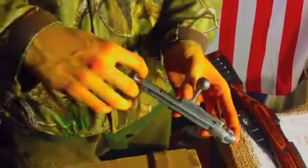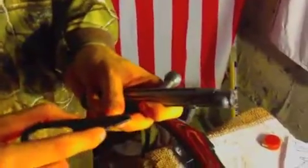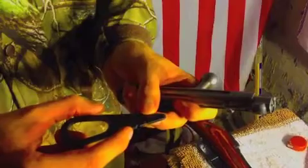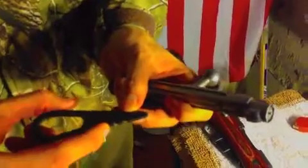Before locking up and putting the bolt back in the rifle, check the headspace on the firing pin. Use your tool: the second one from the right is 1.92 millimeters — that's the no-go. The first one from the right is also a no-go gauge, and it shouldn't fit over the head. If it goes, your firing pin is too low and might not strike the primer.